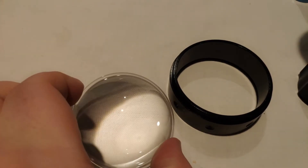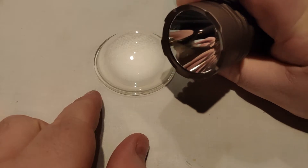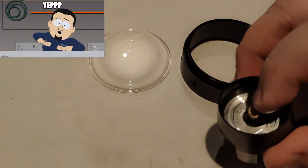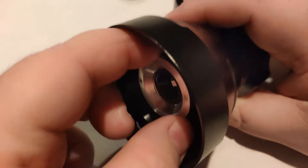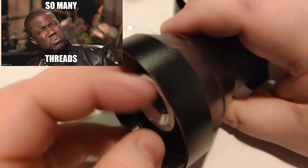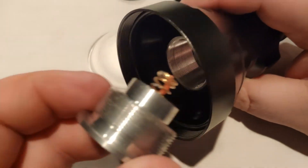Taking it apart - that's the glass lens there, it is freaking huge. Even compared to the C8, it outangles it. That's the bezel, that's the tail cap - it's got one of these little nubs on it, probably brass. I've got a 26650 inside mine. Then there's a reverse thread to get the pill out. It is a pill system - we don't usually love pill systems, but because it's only a low-amperage LED it's not really going to matter too much. It doesn't heat up much, and you can see there are a lot of threads to pass heat onto the body itself.